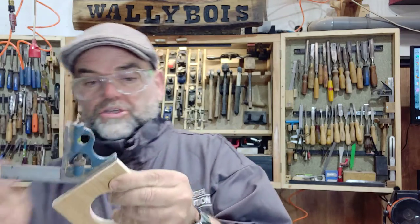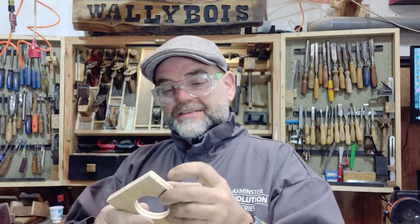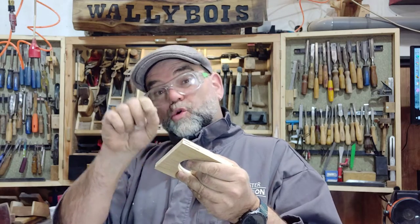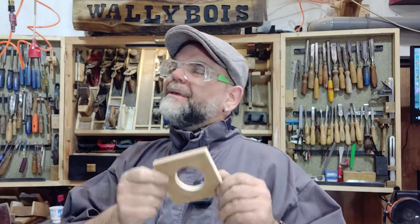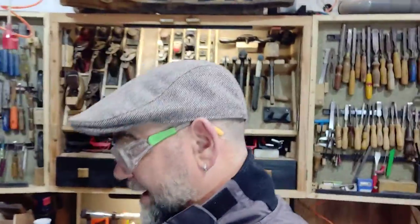The other thing you want to do is cut a 45-degree chamfer on the internal corner. If you put it flat it becomes obvious you could put a 45 on there. I'll mark that with an engineer's square - you don't have to if you haven't got one. I'll mark and cut that off because that piece is the opposite of the 90-degree face. It's a good idea to cut a little bit there in case any glue or burrs on the internal corners of your mitre interfere with the clamping guide.